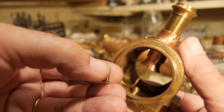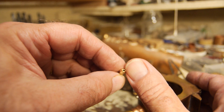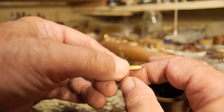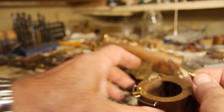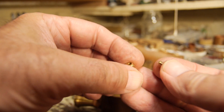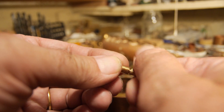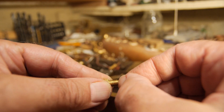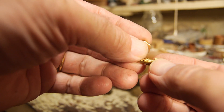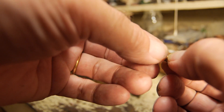This part here is the exhaust jet. In this case I made it with a 70-thousandths of an inch hole. I've sculpted it a bit to make it more aerodynamic — it's a piece of hex brass with a thread on the end. The two pieces screw together like this. I'll put some kind of sealer — either a copper washer or Loctite — in there. To hold it into the smoke box I have a nut which goes on the outside thread.